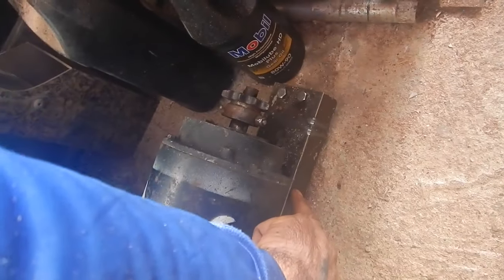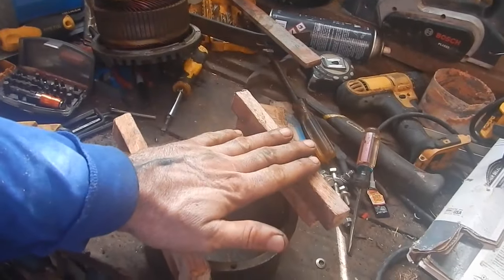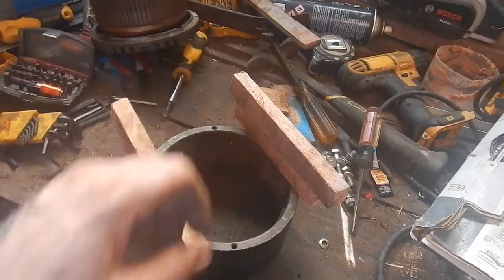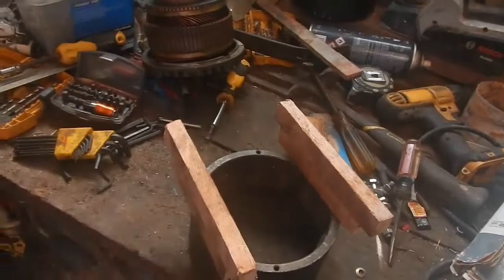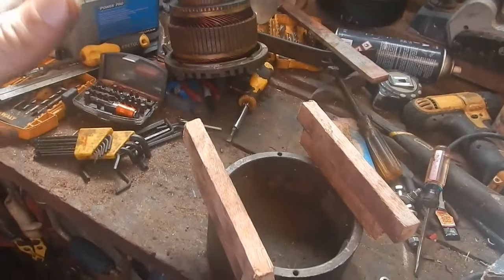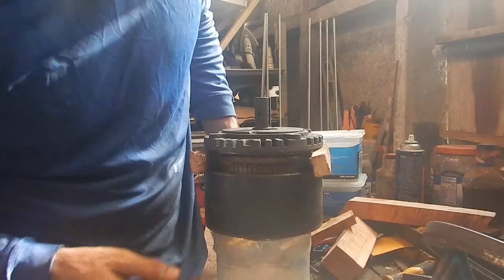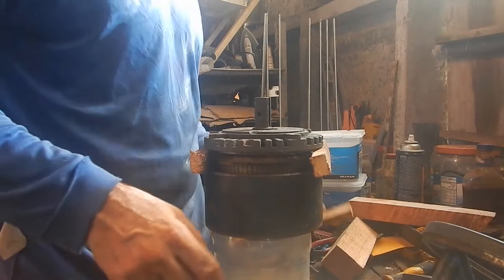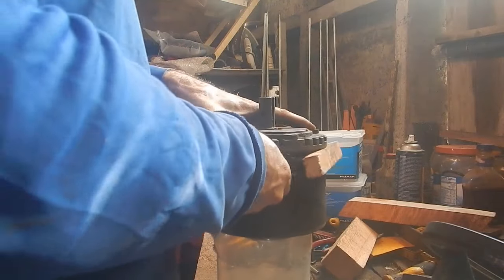All right, well, that only took about half an hour to get out. I do think I want to use this motor. For a couple reasons. We'll get into that, and I gotta put this one back together first. All right, take this, put it on here, and then slowly let it go in there, because what happens here is those magnets are gonna pull on this super hard, and thump! And if I let it just smash in there, something's gonna break. Okay, at this point, this piece is held up by the magnetism. Because otherwise, there's nothing else holding it up, it would fall down. So let's get nice and slow.